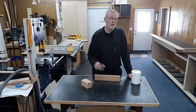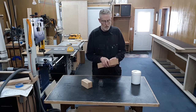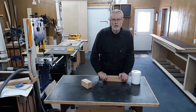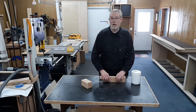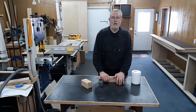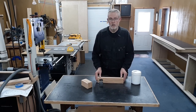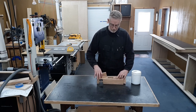It'll just cause friction in the joint when you glue it up. I would use it sparingly because this does grind rocks and steel. So if you were going to mill boards after you glued it up, you wouldn't want much of that in there because potentially it could cause some damage to your saw blades. If you're not going to do a lot of milling, I would say this is the ticket to make that glue-up a little bit easier. I'm going to go ahead and glue one up and demonstrate that — it's very subjective, watching me do it and seeing what I'm going to glue up here, multiple boards glued together.